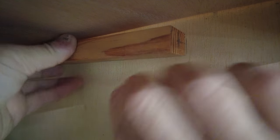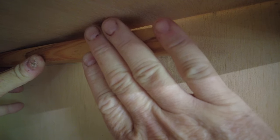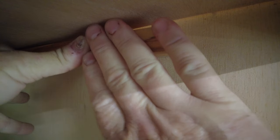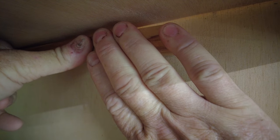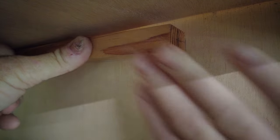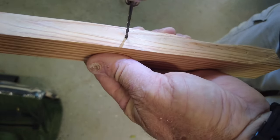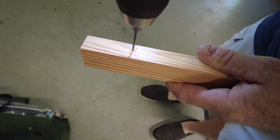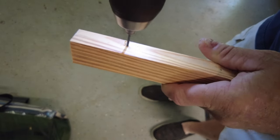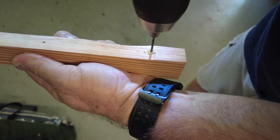Okay, I'm ready for the first hole. Next hole. Next hole. Now I can use these marks to drill the pilot holes for the screws. This could be a one-person job, but you would have to take the cabinet door off. So I'm going to enlist my wife's help — one of us will hold the brace on the inside of the cabinet and the other person will screw the screws in from the outside.